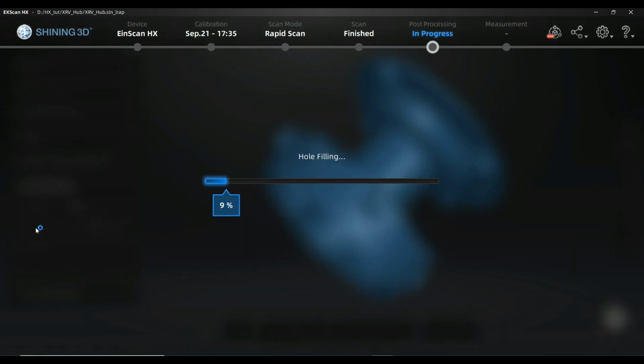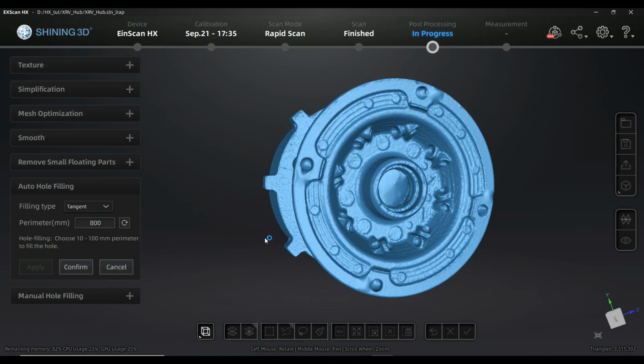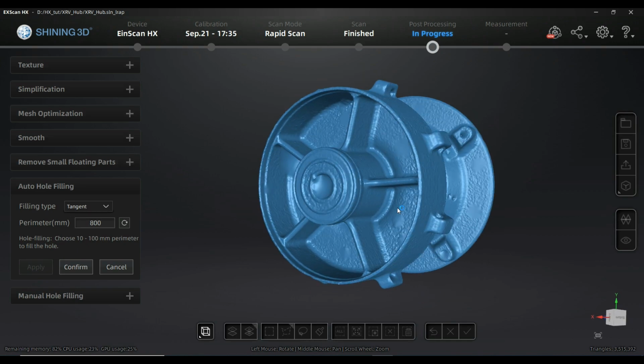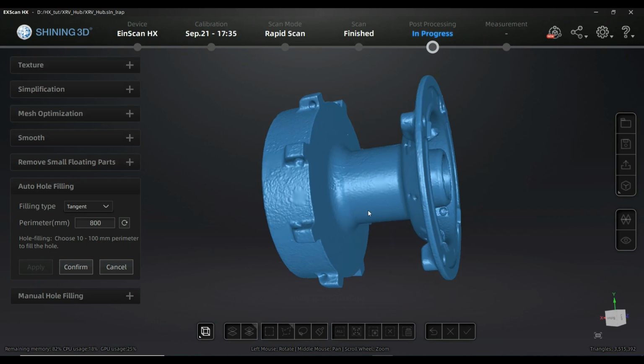Here in this case I can as well, like before, apply and test what is fine for me, if it's doing the result I want or not, and I can change it afterwards if needed. I just put a really quite high value there to be sure everything is closed. It does the job very well, and I'm better off than in the auto mode at least. Of course, if you're using Geomagic or Geomagic Essentials, other kinds of pro software for post-processing and reverse engineering, you might do a much better job. But for a standard free of charge software, that is a really good, let's say, condition.